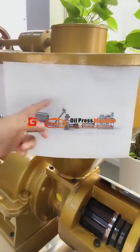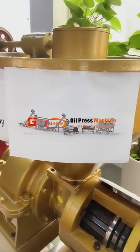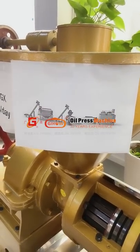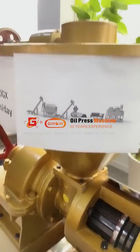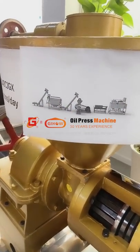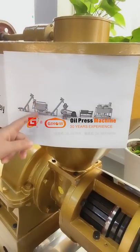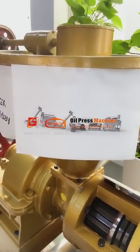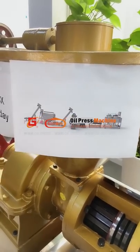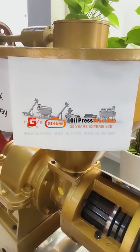Maybe customers will ask, without this one, is it okay? It's okay, no problem, because for oil production, we have two ways to produce the oil. The first is cold pressing. The second is hot pressing. For hot pressing, we need this seed roaster to heat the seeds first, then put them into the oil press. This way will be more efficient.